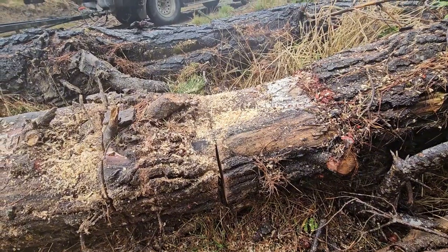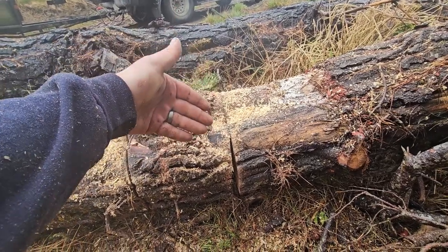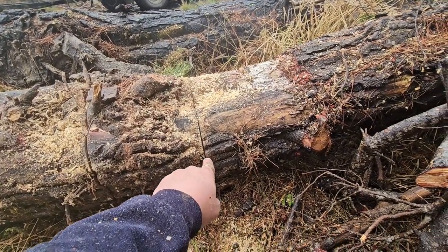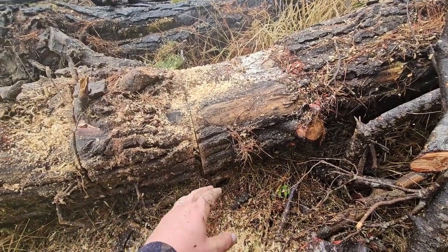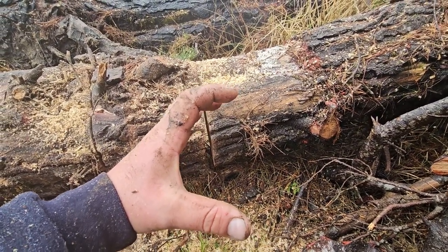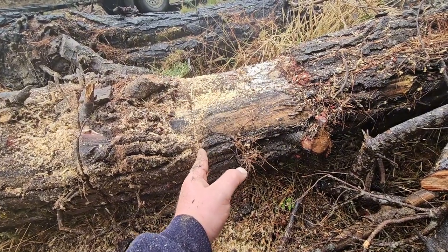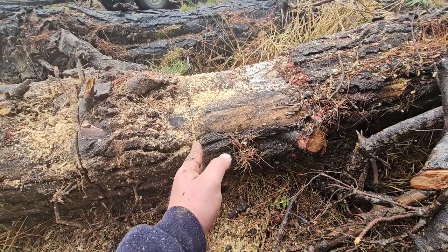Cut all the way through, well and truly. So basically all you need to do is come over the top, bring that other side in a little bit, and then come back around, and then come down maybe just over halfway on the log, that bottom third at least, bore cut in, take it out the bottom, and then you end up with a piece in the center of the tree that is, say, this thick. Then you just come back up, and as you start to feel it go, you just start feathering it. By that I mean you work the throttle and slowly work your way up.